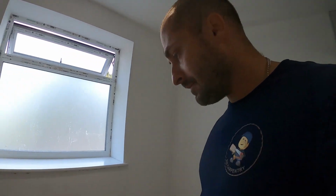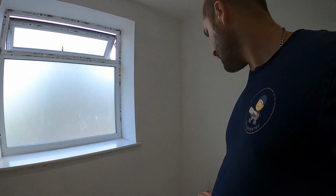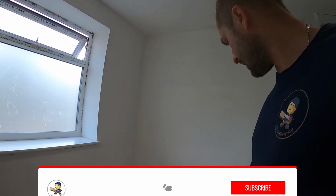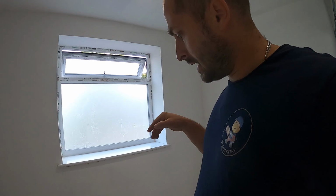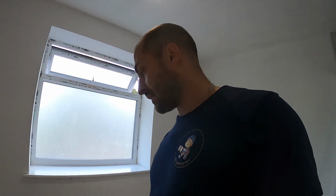As with every flooring, with this flooring you need to leave an 8 millimeter expansion gap, and keep that in mind. Obviously floors need to be clean without any lumps, so that's the first job you want to do. Prepare your floor, make sure there are no lumps and bumps, because this is only thin flooring and only thin underlay, so any unevenness in the floor will show. If you do it on a floorboard, don't forget to screw down any loose boards, or check that nail heads are not sticking out, because they could potentially damage your floor.